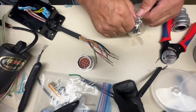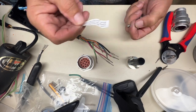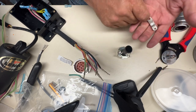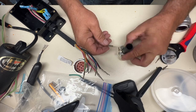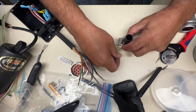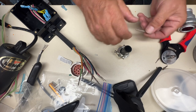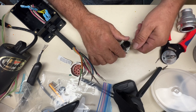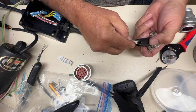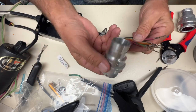As I build this, I want to put my strain relief together first - this little rubber thing. This all fits in here together; these oppose each other because one's got thread and one's got a pass-through. We put the screws in here. So I want to do this first so I don't forget, because that's usually what I do. I slide this over all my pins, push it back to where the rubber is, and now I'm going to work on my actual pinning and socket out.